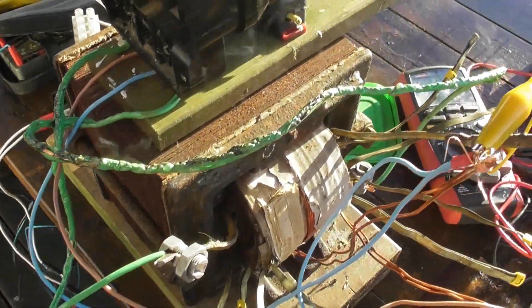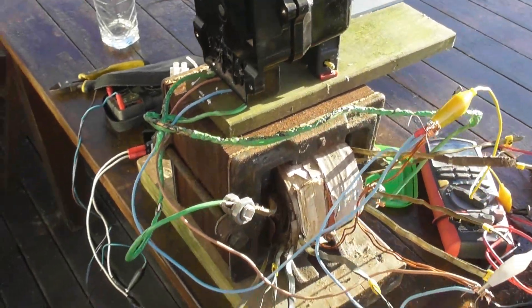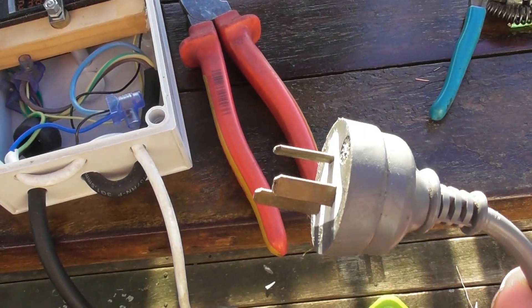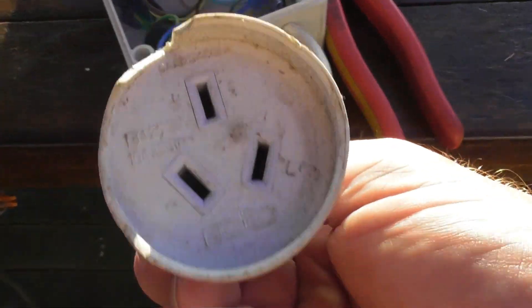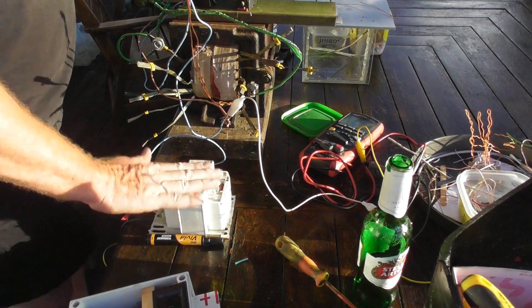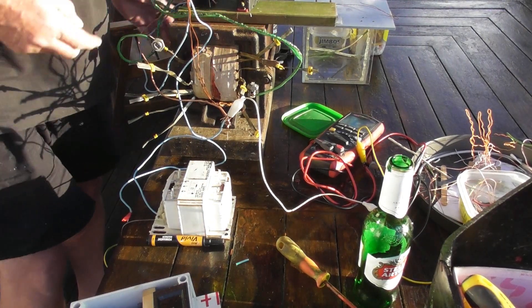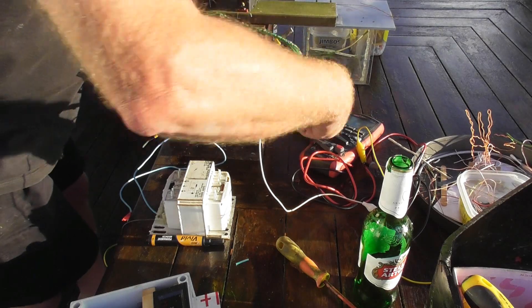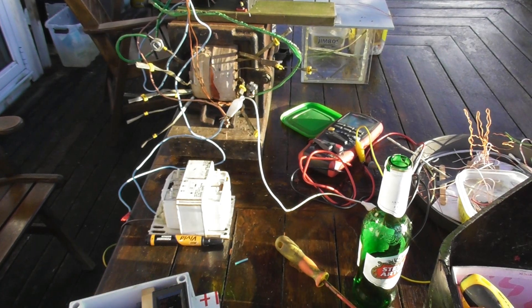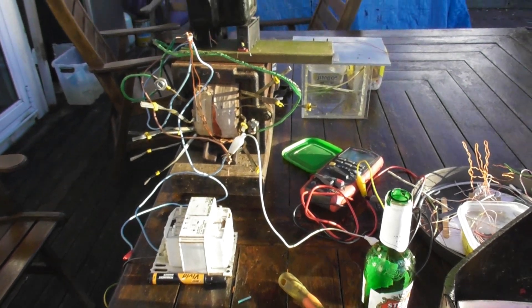The bit of green 4mm wire got cooked quite nicely. I don't want to damage my meter or anything else, so I've de-energized — most important thing is always unplug from the receptacle first — safety first. Checking: the ballast is warmish, the winding is cold, connectors are not too bad. This is quite a grungy transformer. I will put another ballast in series to reduce the current for more appropriate testing. Thanks for watching — part two.